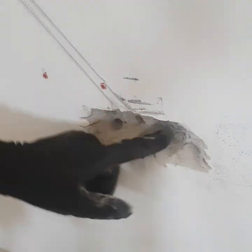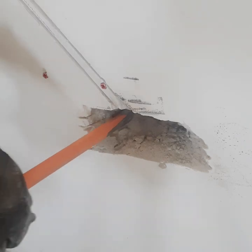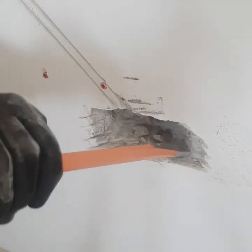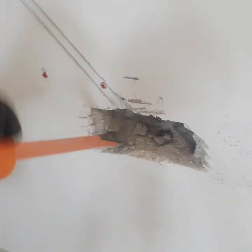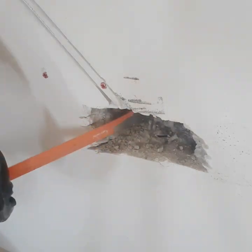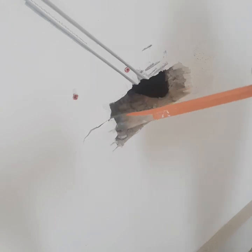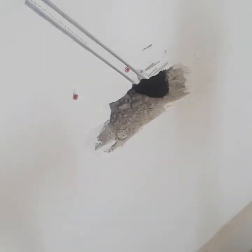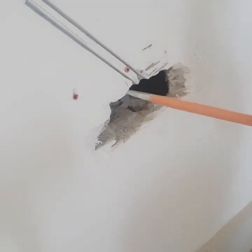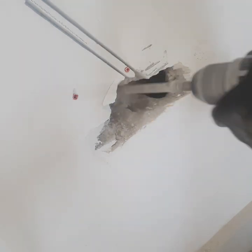It takes patience to do this box. Right there I'm just tapping away with the chisel — this stuff is no joke. You just gotta chisel away till the box fits and is pretty flush. You don't want the hole too big either, because then it'll just be rocking all over the place and you'll have to add a whole bunch of cement to get it centered.